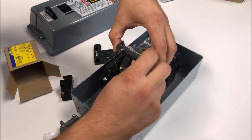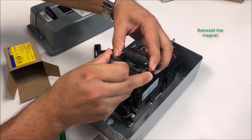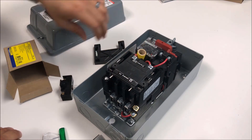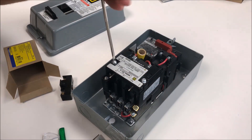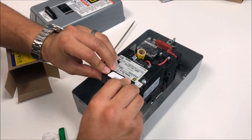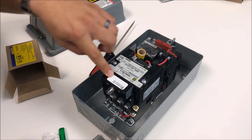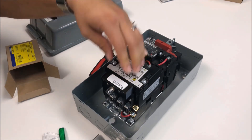Take your coil and position it right beside the coil of the starter itself, then slide your magnet assembly right back in. Then you're going to reinstall the whole assembly of coil, magnet, armature — and now you have the pilot light coil — and then reinstall your cover plate. These two little stabs here will install right on the socket itself. Install it from the top down. This actually uses an induction current when your coil is energized to give the indication that your pilot light is on and that your starter is closed or your coil is getting voltage.